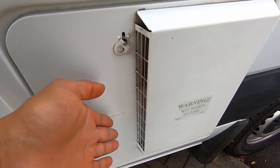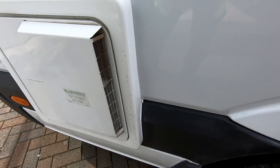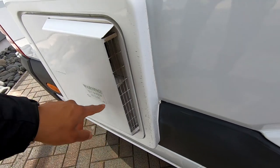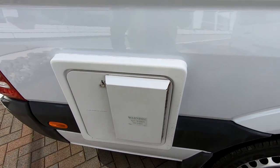Gently move your hand up and down here and you'll feel the heat coming out — there's quite a bit of heat at the moment, so you know it's on. Now sometimes with these Suburban type water heaters it's quite easy for wind to go in here and blow off the flame. In that scenario, turn the camper around so it's not facing the wind.